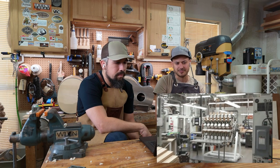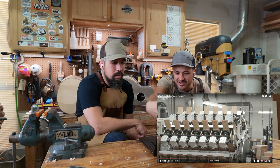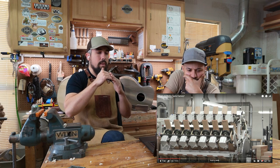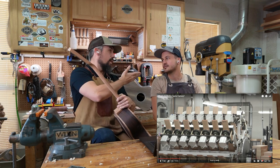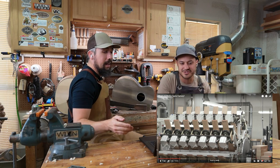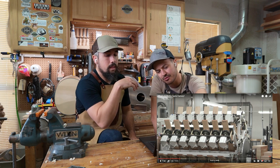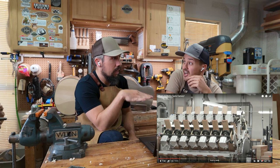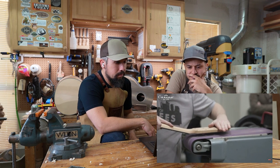You can see they're all glued up. That's another carousel kind of thing — these are all pneumatic activated clamping. A scarf joint headstock is difficult to glue up; when you clamp it, the headstock piece wants to slide off. They've solved that here. We've got six, seven guitars per row and looks like ten rows — I read somewhere that Taylor does like 650 guitars a day out the door. So right here we've got a little pile of necks with the scarf joints — the Taylor necks are two pieces, glued together.